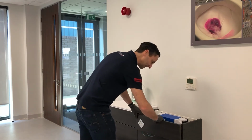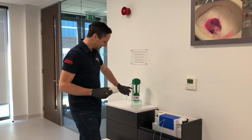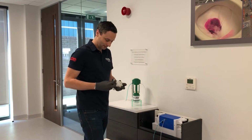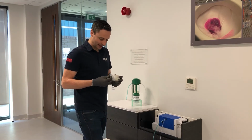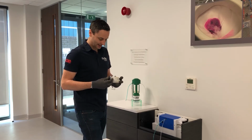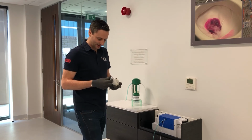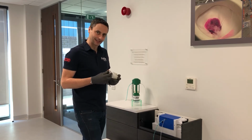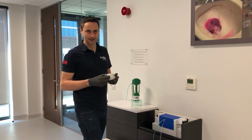In order to do that, and I'll just demonstrate here simple enough, is with the tubes disconnected from the flush valve, press your finger over the 2 spigot connector points. Then press the full flush button, and do you feel resistance? And again, press the reduced flush button, and do you feel resistance? If you don't feel resistance, then that is likely the button at fault, the piston seal has failed and it needs replacing due to wear and tear.